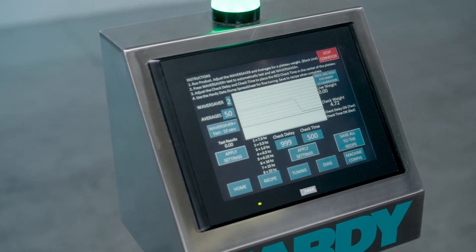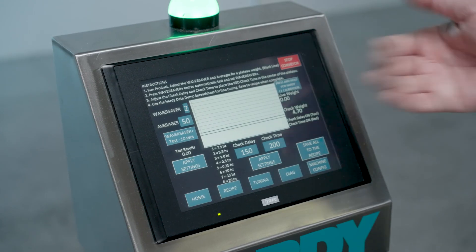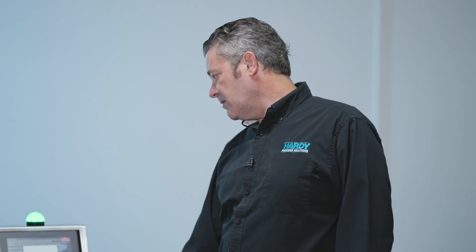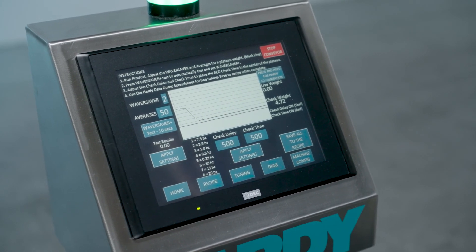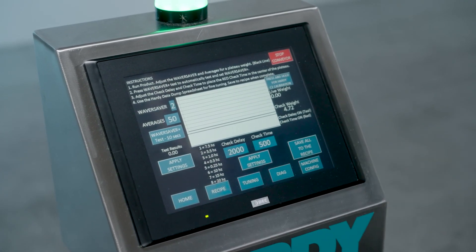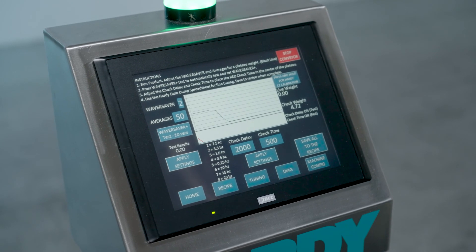I just calibrated the machine with one button. The final step is setting up timing. Ideally, we want to weigh the product when it's in the middle of the scale, although weighing on the ends is also okay. In a production process, not everything moves through at the same speed or pitch, so weighing right in the middle is ideal. Instead of special software or tools, we make it a visual process — projecting everything to the HMI so you can watch the process live. Running a product across, you can see from the weight trace that we're capturing weight a little bit early. I'll set a delay of about two seconds and run another product across. Now you can see from the red trace we're catching the weight right in about the middle of the plateau — that's a really good setting.